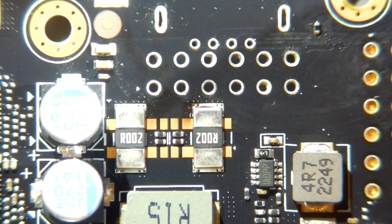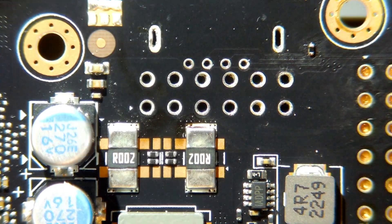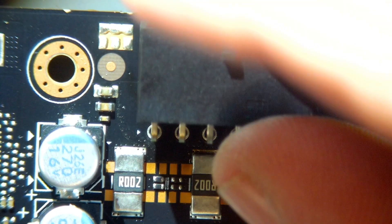All the lead goes to the bottom and everything should be clean. Looking at the front of the board now, we have some nice clean holes, and our replacement port is right here. Looking good. And what we're going to do now is just attach it to the board.